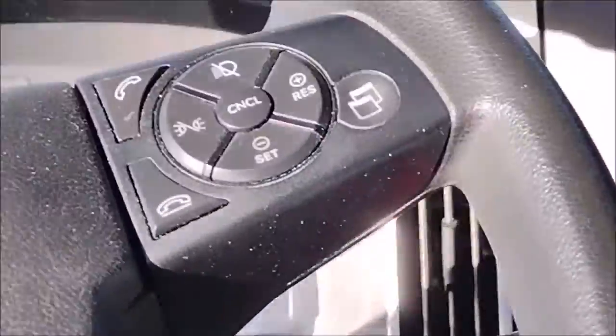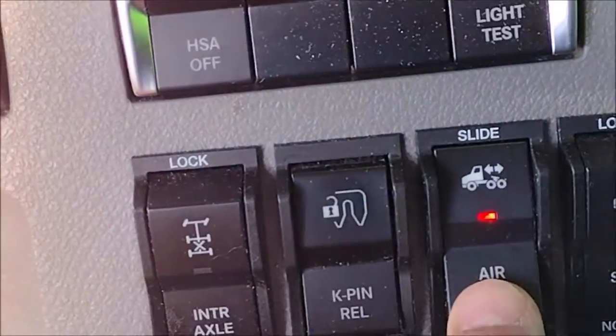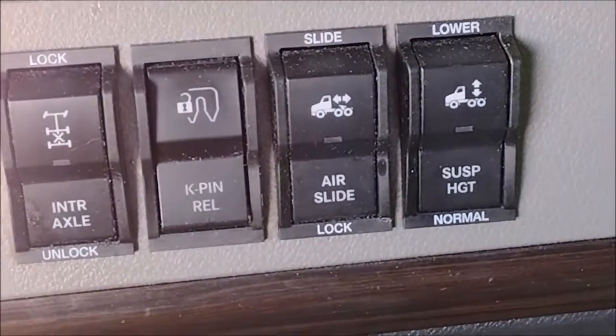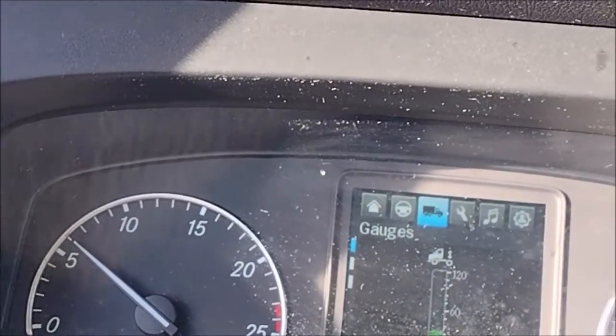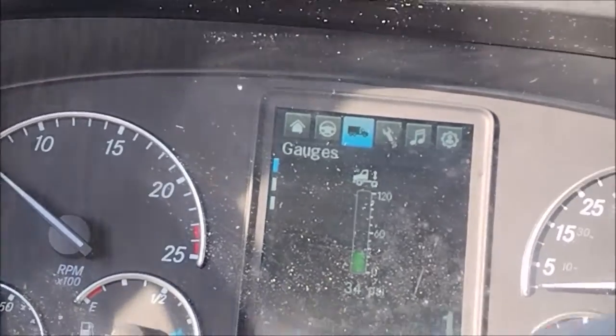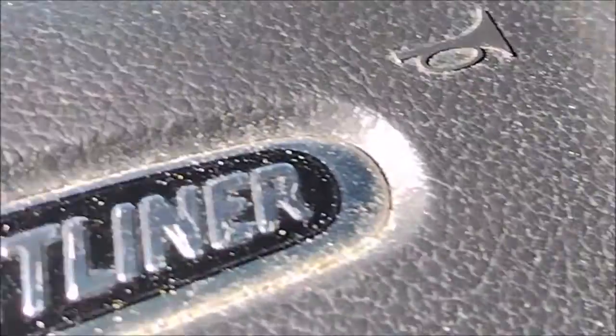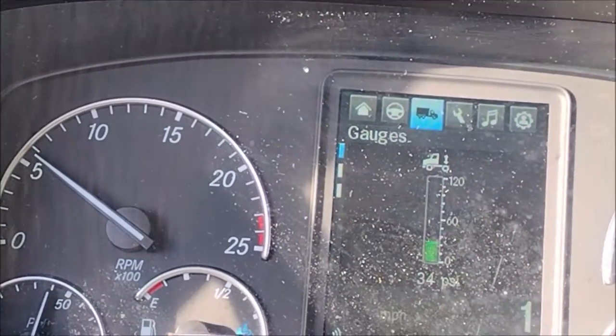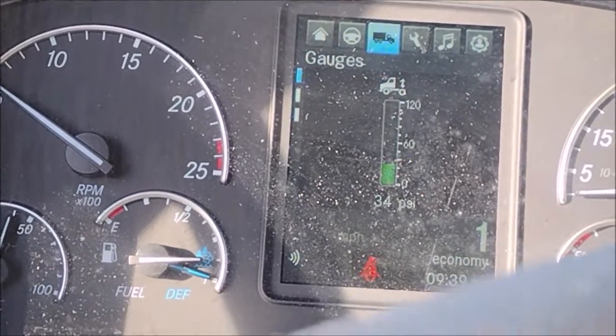Once you get into an accident with the fifth wheel, you learn your lesson. You start listening to every detail in the manufacturer instruction. We locked the fifth wheel. We are going to pull forward first. Forward. Then we are going to try to go backward to see if it's locked. And that is the most critical part now.